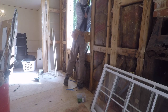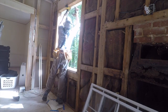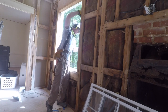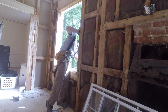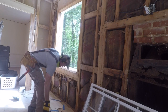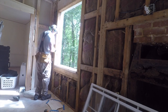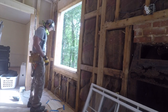One of the challenges of the Pella Architect series is that it has to sit on a level mount, so you have to do a balance. Ideally you'd like to have about a 12-degree decline for water to run off the sill. But then you're going to end up with a large gap that you have to caulk because the Pella frame will sit flat against that — so on the outside you'll have a big gap. You have to strike a balance between water flow and water runoff, unless you bevel the outside of the sill itself.